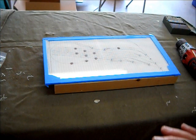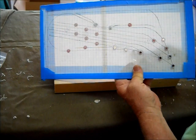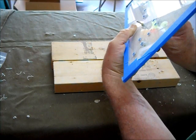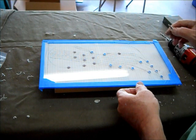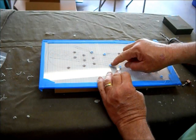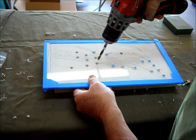We have all of our pre-holes drilled and now we just go up to the quarter-inch size. I've already drilled some of my quarter-inch holes and I'm going to verify they fit the switches — you can see that if I push on them hard they do go in, and they stick out just enough to get the nut on. Now that we've verified the holes fit we're going to do the rest of them. While drilling you'll see the bit gets kind of hot and leaves a little lip, but don't worry — you can go back with the drill bit once it cools off and run it through fast to take that lip off, or trim it off with a knife.